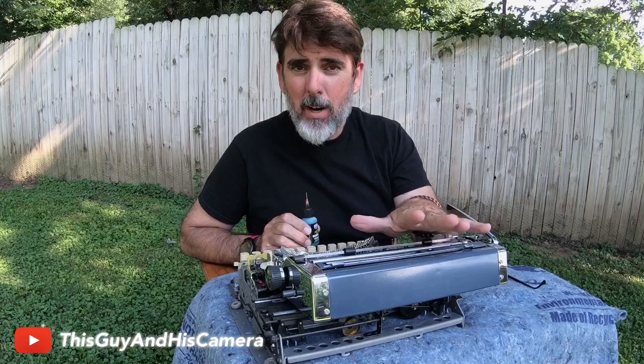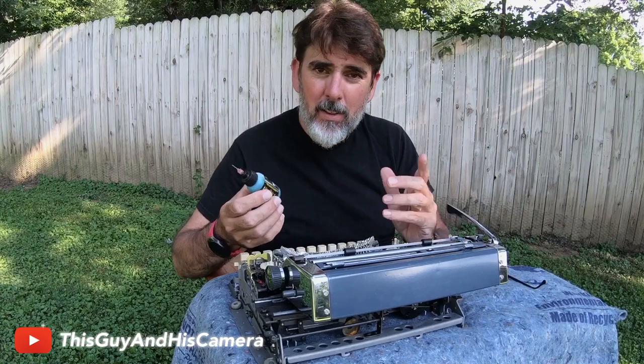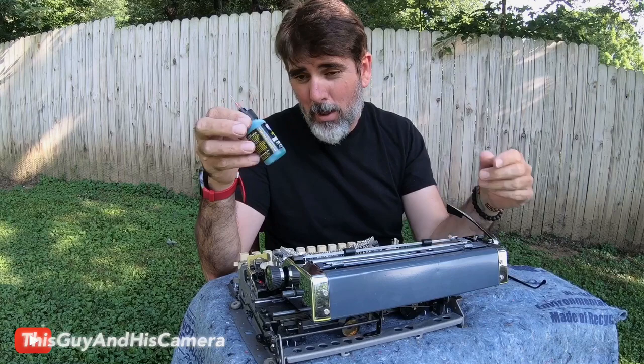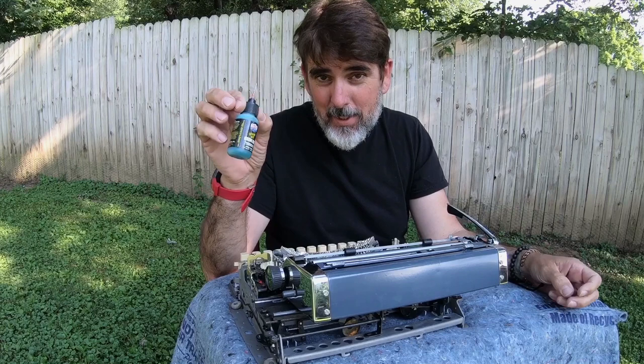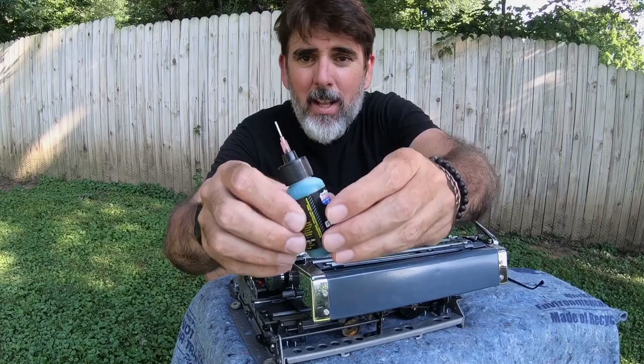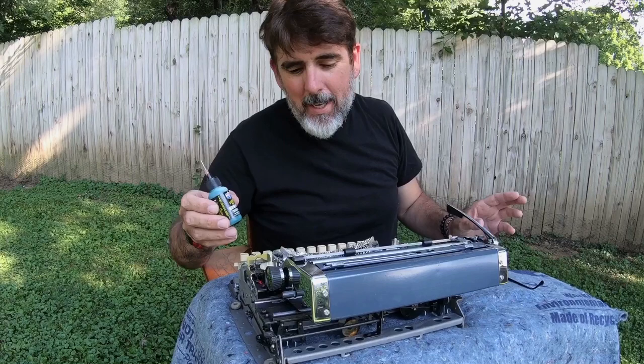Now that we've stripped all that out, since the majority of the typewriter is all moving metal parts — metal on metal — this is the second product I've used in this situation. It's the Lucas Extreme Duty Gun Oil. You can find a link to it in the description below. I found this at O'Reilly's Auto Parts on a countertop display. It has been a really good oil for me so far. What I used prior to this was a hobby bottle with the same tip, and I put Duralube in it. Duralube is a fantastic additive I've used for years, but if it's that good for a car, it's got to be that good for a typewriter. So what I'm using now — Extreme Duty Gun Oil.